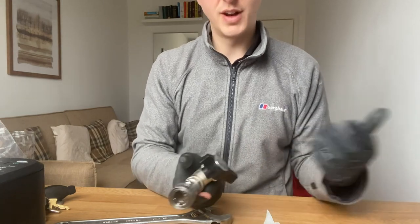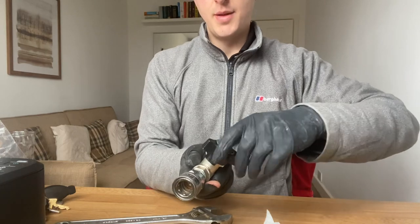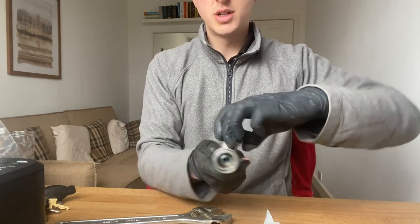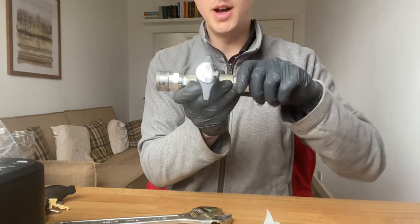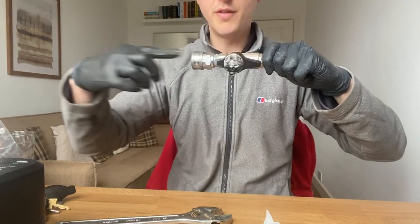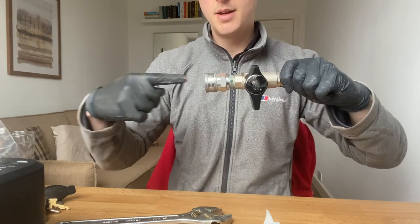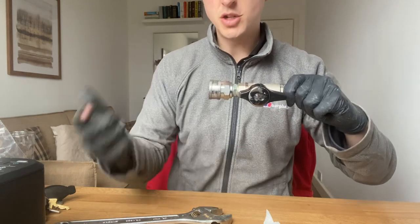By slightly opening up your ball valve, you can rinse everything down super fast. It's a really efficient way of cleaning — you don't have to turn off the pressure washer. When you're ready to connect a new tool, just isolate the ball valve — across the line means it's off, in line with the flow means it's on. Isolate, connect back up, open the flow, and your tool is live again.